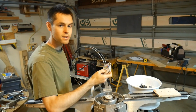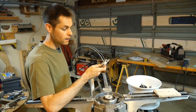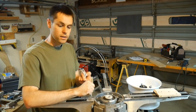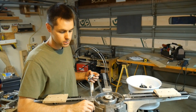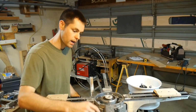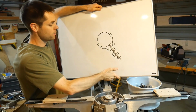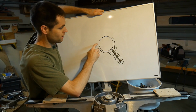And at 27 thousandths of an inch, it's rated for 90 pounds. That's the test rating on this. We can size the cable appropriately to get the strength that we need, the limited stretch, and also the bend radius, because this cable is going to have to be anchored, come around, go like that, and then back down.